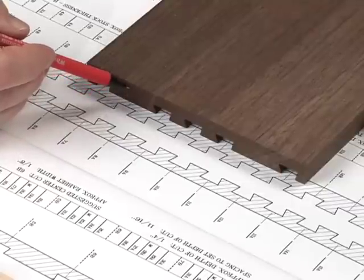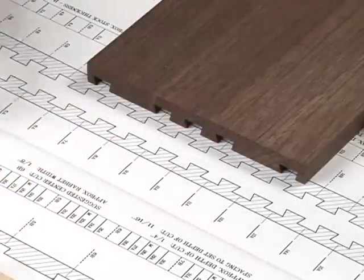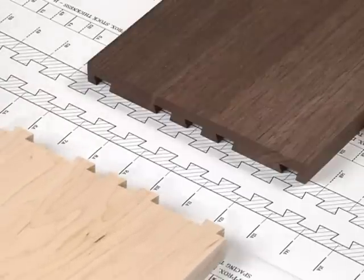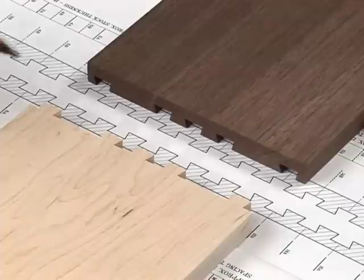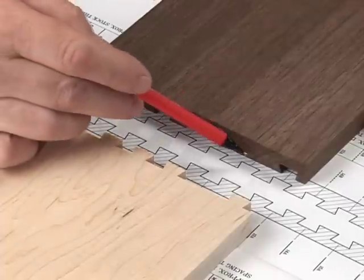On this pin board, we skipped cuts 8B and 12B during the cutting process. This leaves wider pins between the sockets. To modify the tails to match, we simply make all of the required A cuts, plus we add in the two B cuts dropped when cutting the pins.